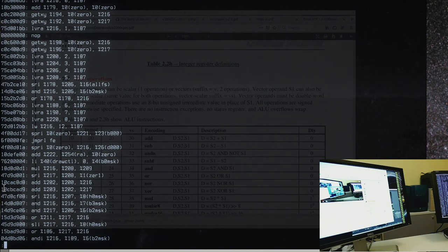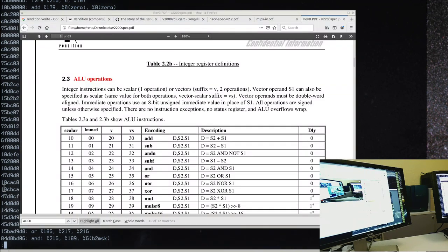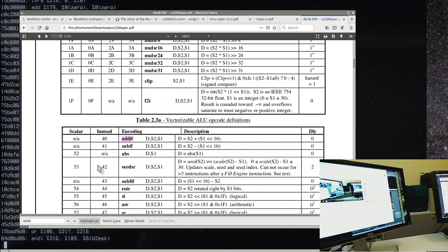Look, here, this is really in-depth. This is what I try on my channel. Really show you how this stuff works in-depth. Disassemble stuff, look at the specification, match this stuff together. And again, this RISC code is not drawing all the pixels. It's doing the setup. So for example, this code could do a triangle setup, and maybe even theoretically, not sure if it's fast enough, but it could theoretically do transforms.